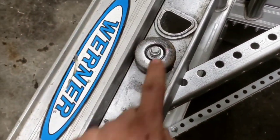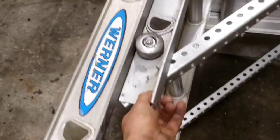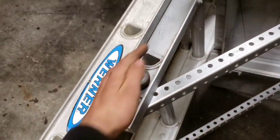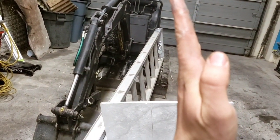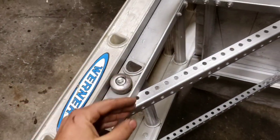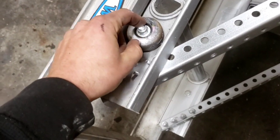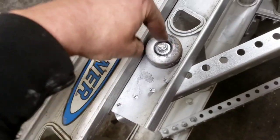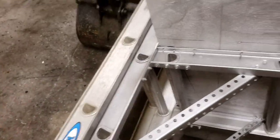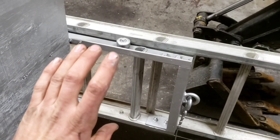This is where it got fun — this is a skateboard wheel, just something I had lying around. You need some type of wheel or bearing to ride against the face of the track. When the ladder is tilted up against the building, the weight sits on the back end of this wheel, and as it's pulled up with the hoist the wheel rolls, creating a lot less friction than aluminum grinding on aluminum. It just gets bolted in place — we held the wheel, drilled the hole, and bolted it together. We ended up going with four wheels total to make sure the carriage doesn't jump around too much while being lifted.